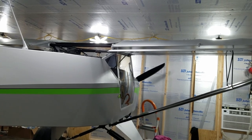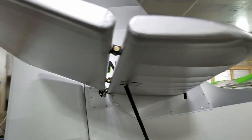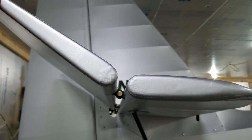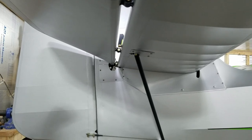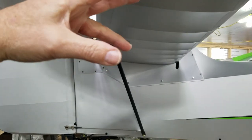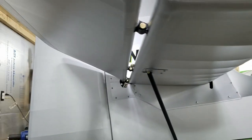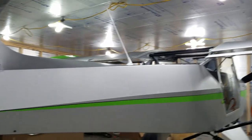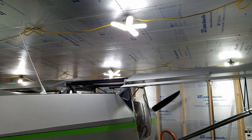When you get a wing up here that'll go slow, now the problem is the elevator was good to about 40 mile an hour, and then your full up elevator quits you. The air comes off of here and it just leaves the elevator when you get too slow. So we'll put the Vortex generators under here in a row, and then that will hopefully keep the air stuck to our elevator down to the low 30s where we're hoping to be stalling when we get to flying.